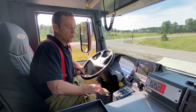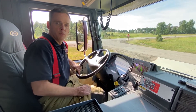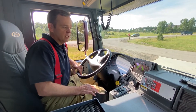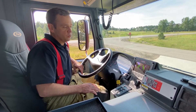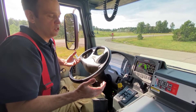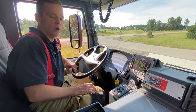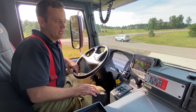To switch this over to pump mode, the first thing we want to do is make sure that we're appropriately positioned where we want to be operating from. Once we're satisfied with our positioning, we switch over to pump mode. First thing is to switch over to our fire screen. Our fire screen will show us all the things we need for pump operations — it'll show whether our pump is engaged and the actual pump RPM. Our pump spins all the time because it's on a power takeoff.